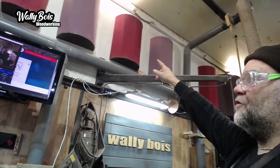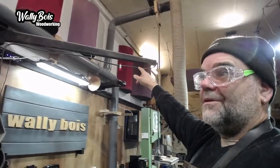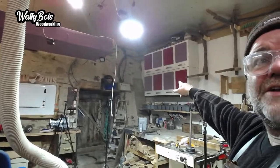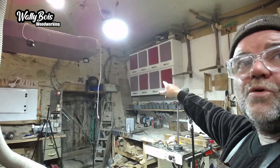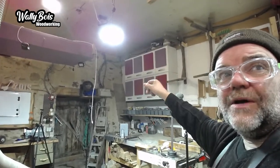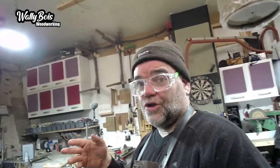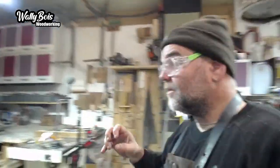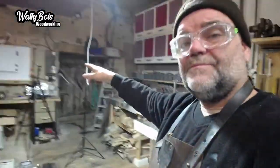They're full of fiberglass insulation with an old sheet stapled over them. But also, over there, on all those unit doors, because they were a problem. All those little boards on there are actually about 2 inches thick, screwed to the front of the doors, and they've got foam in them as well. It has to be a proper foam, you can't use polystyrene, that won't work at all. It needs to be something that the sound can go into and become trapped. Same over here, and the same over here.